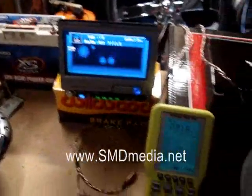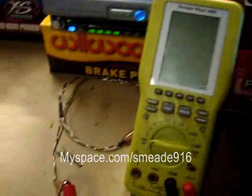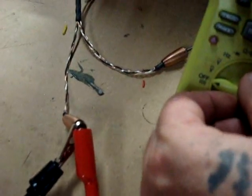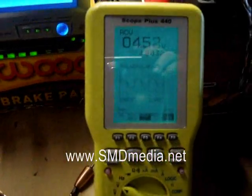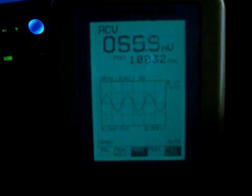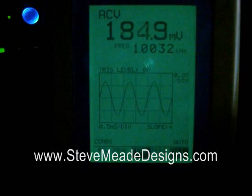Since this deck doesn't really like to clip on track 10 at minus 5 dB, we're going to put it at 0 dB, track 7, 1000 Hz. The first thing I'm going to show you is what clipping looks like. To do that, I'm going to put my probes on the mids and highs out — I'm on the fronts right now. Put your O-scope on AC volts. I'm doing track 7, that's 1000 Hz at 0 dB. As I turn this deck up, you will see this wave forming. See how the wave is nice and round? I'm still on volume 31 — still looks pretty good, it's not clipped off yet.